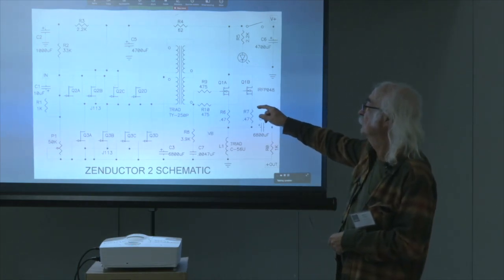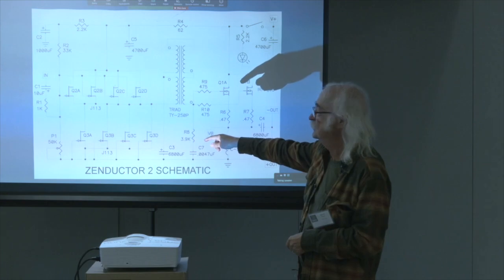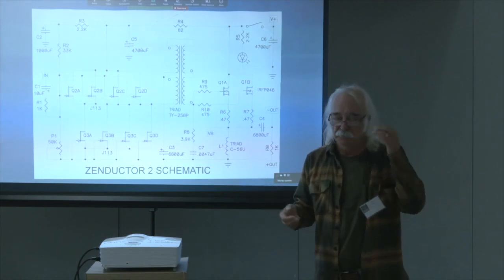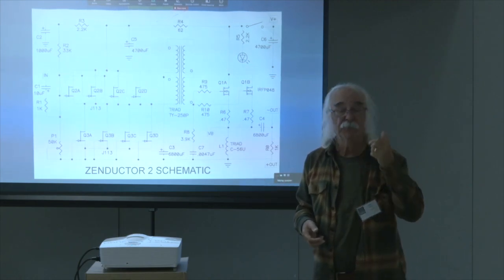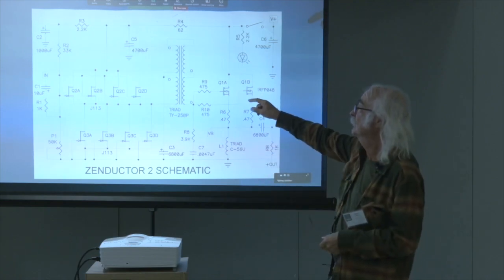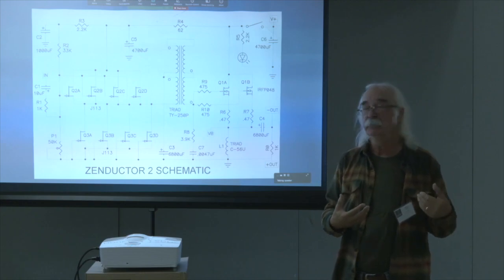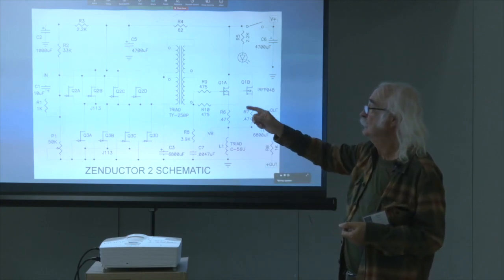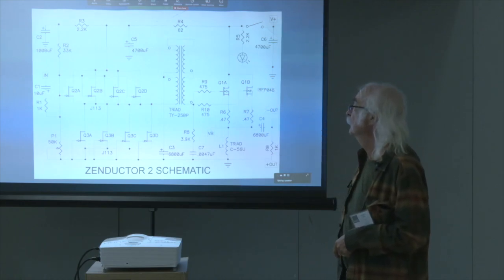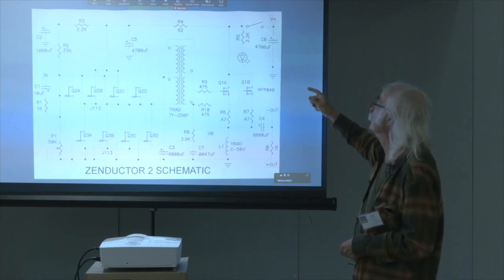It's tapped so that a signal comes in. I have these followers, which are just JFET followers running in parallel. The ones down at the bottom here are just a pure current source, very simple. They're not actually doing anything other than providing constant current. The devices above that are the array of Q2s. Those are followers. All they do is buffer the input so that whatever you've got for a preamp doesn't have to try to drive the fairly low impedance associated with this little transformer. The stuff up there is for setting up the voltages and filtering the noise out from the power supply.